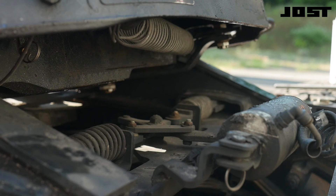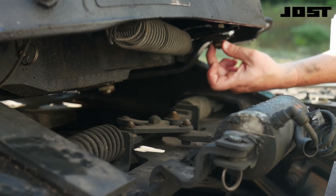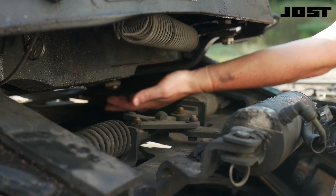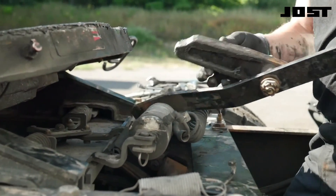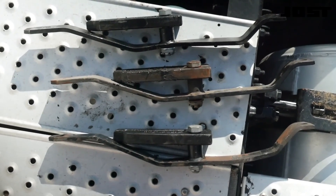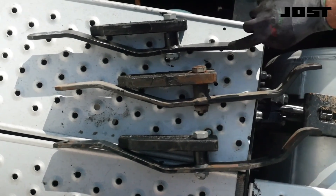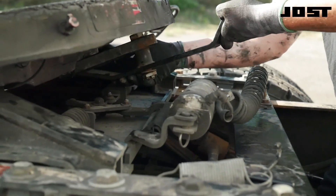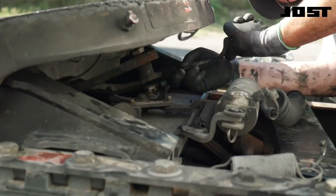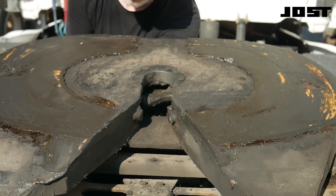From the passenger side of the tractor, look under the top plate to check the condition of the following items. At the release handle pivot bolt, the lever with bushing must be parallel with the underside of the top plate casting. The top plate remains on the brackets to replace a lever with bushing. Remove the lever with bushing and the locking bar together, transfer the locking bar to the new lever with bushing, and reinstall. If the tip of the lever with bushing is pointed up towards or down and away from the top plate casting, replace the damaged lever with bushing.